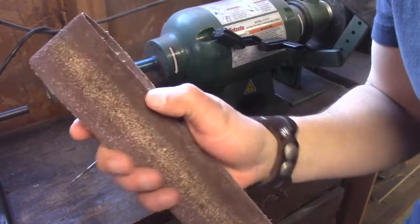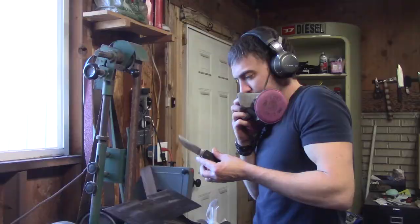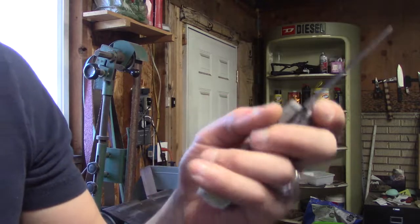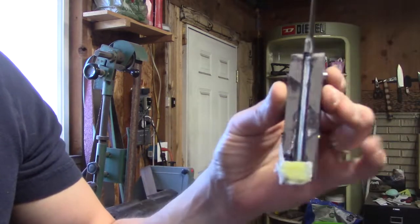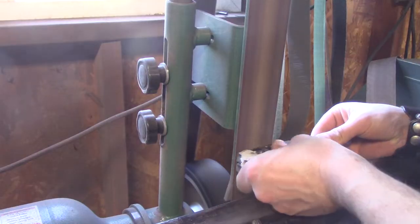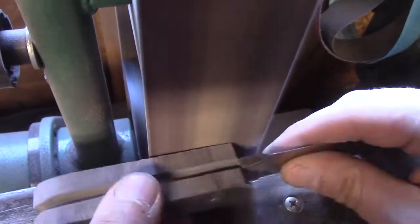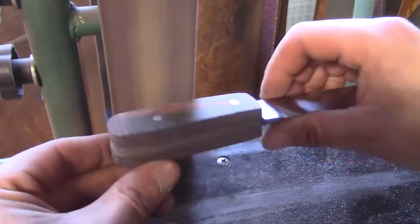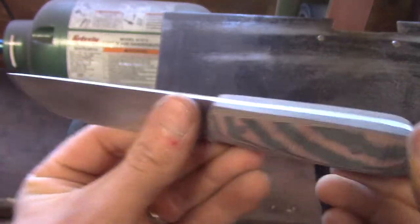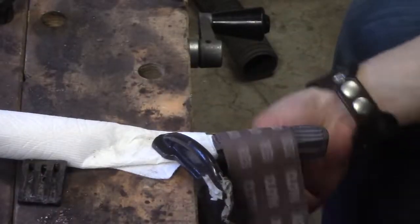I go over different belts I use in my 2x72 grinder review — go check that out if you haven't seen it. Alright, I got the pins off. It's still really bulky so I'm gonna be using the grinder to get a lot of this down, then I'll be hand sanding to do the rest. You can see this is red and black micarta. As I grind more, the red starts coming out — I can give it stripes or any design I want, taking more black out or more red out.